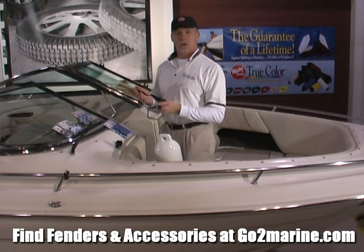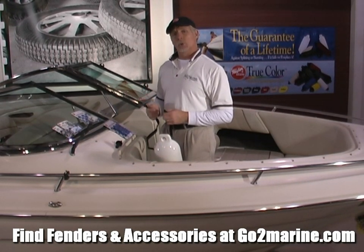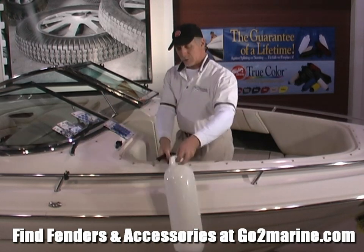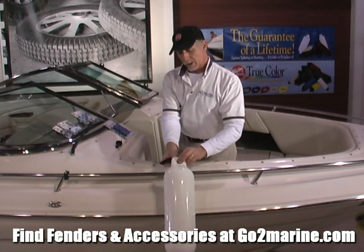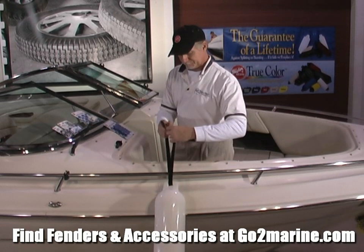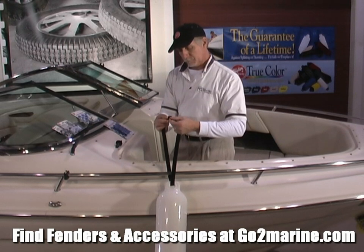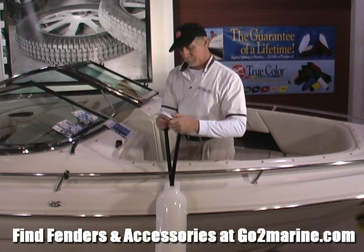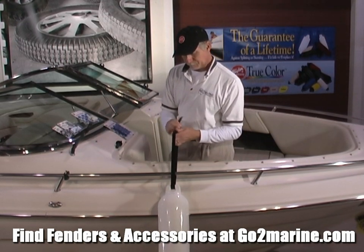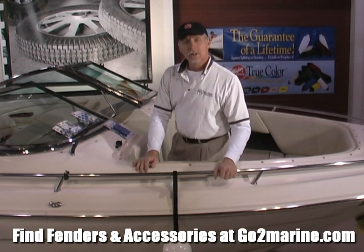This is our hook and loop strap adjuster. Kit contains 3 pieces of webbing with hook and loop fasteners sewn on that allow for the adjustability. Now the way you use this is take the strap, hook it around your lifeline or railing. One end goes through the end of your fender. The other end back up to the buckle. Slide that through and then adjust and hook the webbing fasteners together at the proper position.